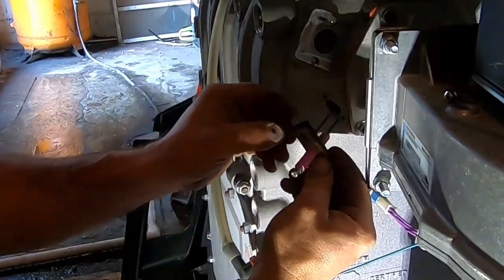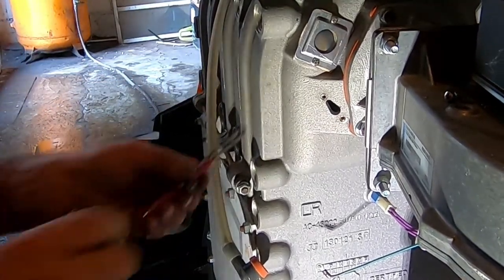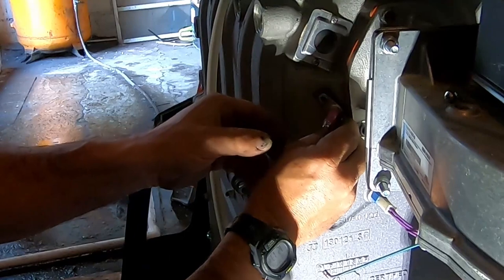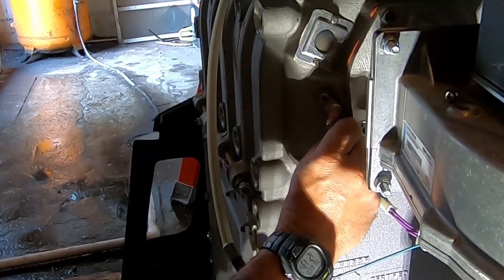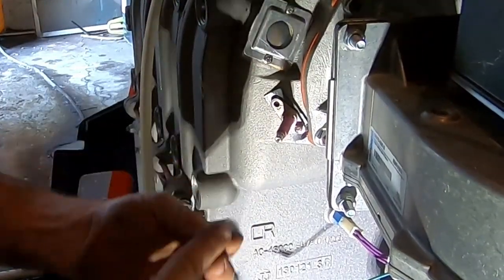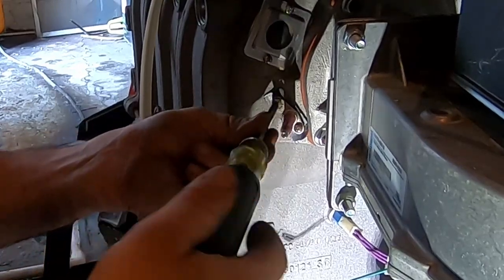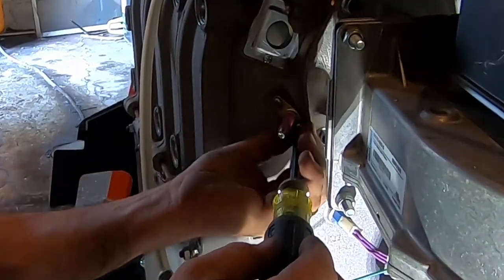It's got a teardrop — you can see it. We can take a look inside; it looks pretty clean. If it's got the same maintenance recommendation as the Ultra 155, it should be cleaned once a year or every two years, and you've got to order gaskets. It looks like they've used red silicone on this one. Now, if we're putting it back in because we're dealing with aluminum, I don't want to break it and leave them without heat — that's one of the things you always have to watch out for. You don't want to come in for something where they at least had heat and leave them with no heat.